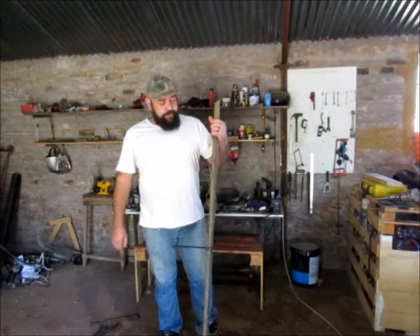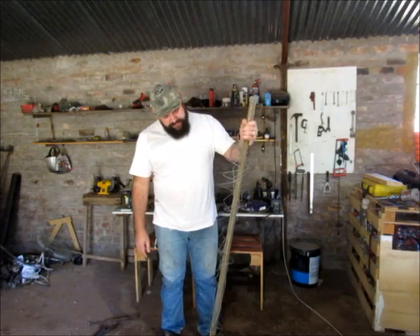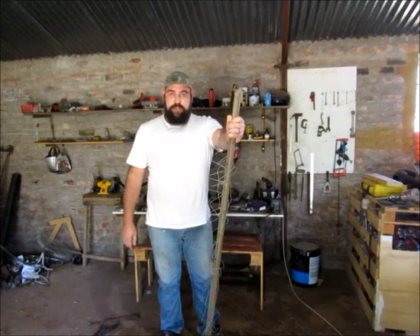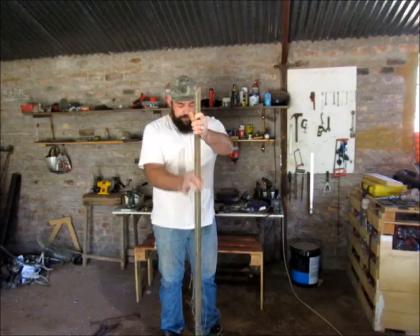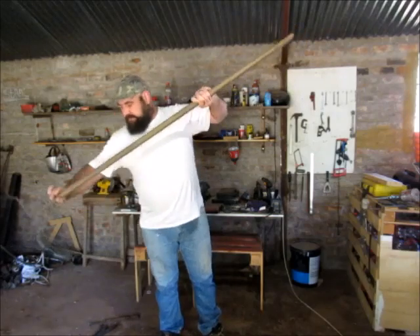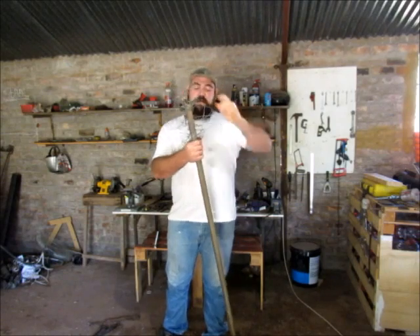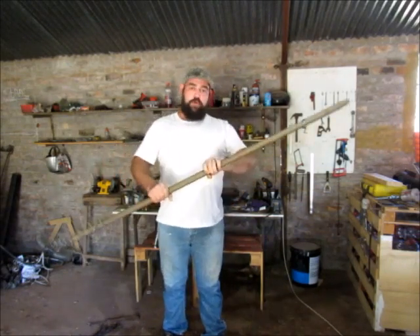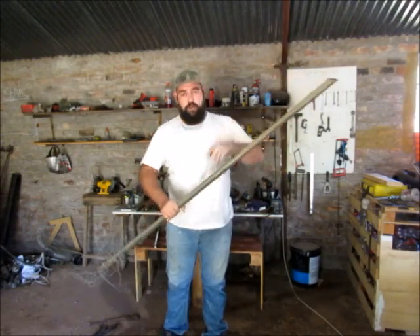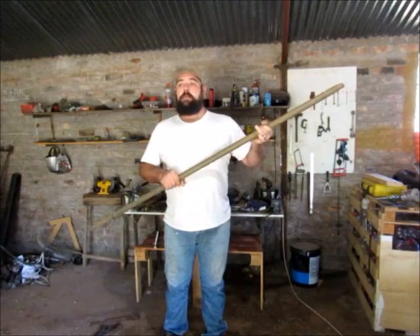So I've got this little piece of pipe here — a really thick galvanized pipe that used to hold a piece of fencing and pull the fence tighter. That's not needed anymore, so I just removed this piece of fencing — probably better not to use the ungloved hand, but that's fine. I'll only be using a short piece of this anyway. Now I need to cut this and drill the two holes I showed you on the door, then go install it and make this door pull straight again.